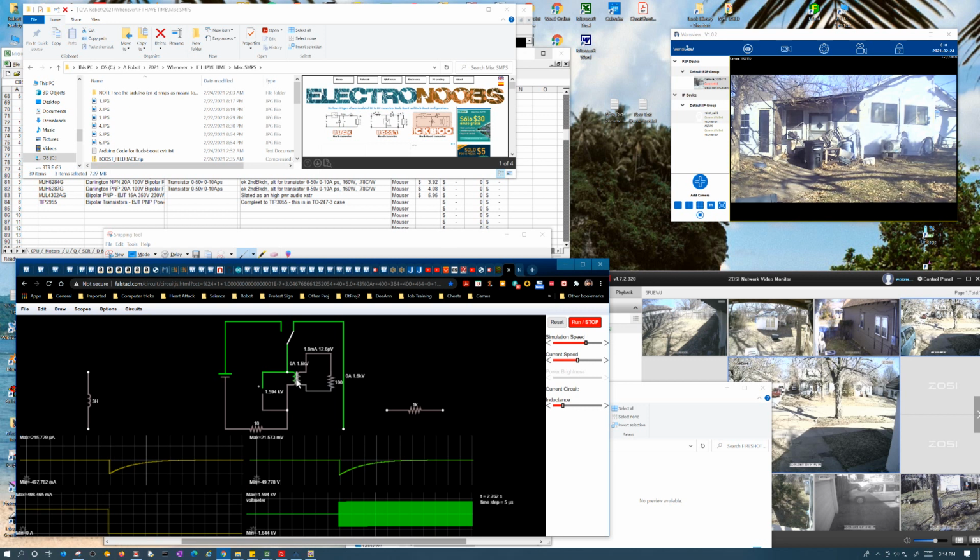What was the current going through this thing when we switched? Because that's a key point. Whatever current this had, it tries to maintain when it switches to the secondary. Since we don't have our resistor here, none of it's going through that, but it is freaking out on the other hand, trying to generate really insanely high voltages just because it's got an open terminal. But still, this resistor is satiating it, so I'm not surprised to see there's a high voltage potential here, but I am surprised, not that surprised, but a little.